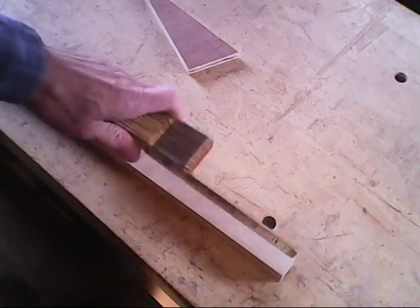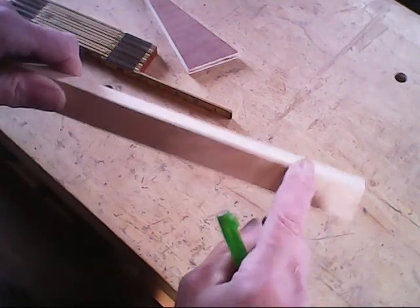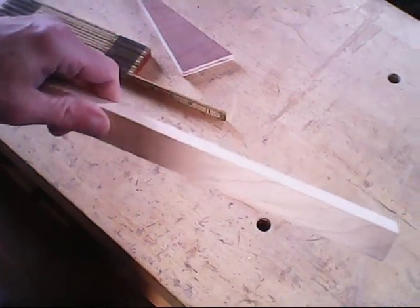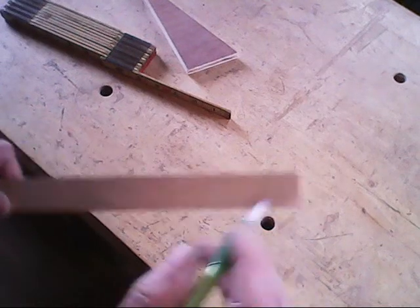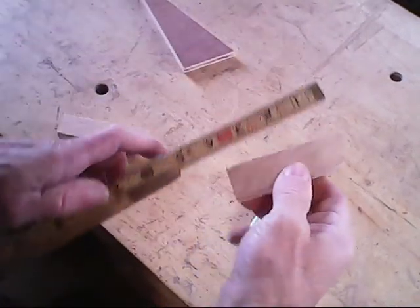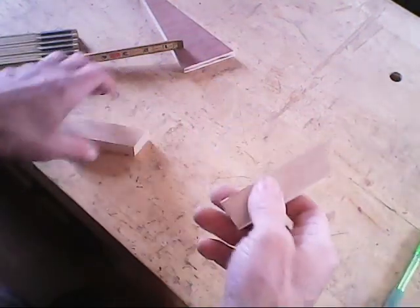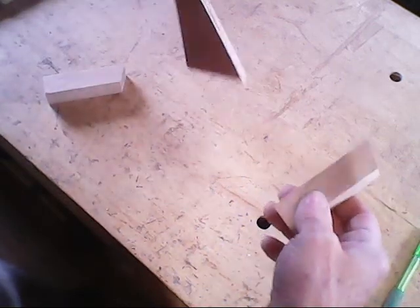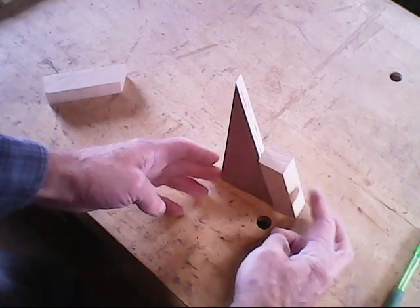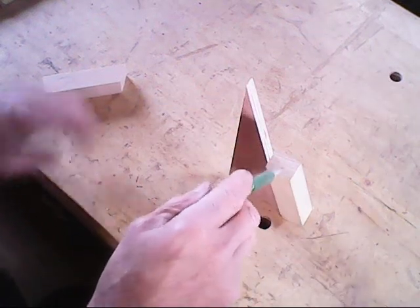I'm going to cut this roughly to about 3 inches — that should work. I'm going to cut two of these blocks out of the same piece and make sure that there's the same width all the way down for this system to work properly. I have my saw set up at that 21-degree angle. Both of my jig blocks are cut, and after they've been trimmed, they're about 3½ inches — could be anywhere between 3 and 4 inches. We have our templates sitting here and we take our jig block, lay it up, and that makes it nice and flat. We're going to do our X-pattern to get the center of these blocks and then do our drilling.